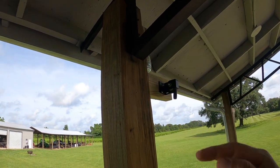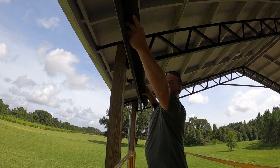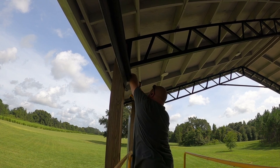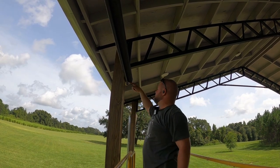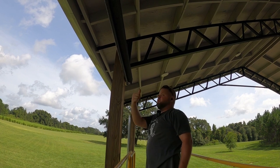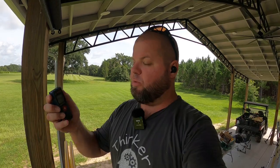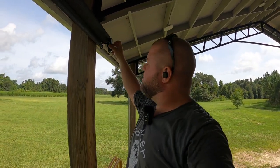I really want to push this in before I tighten it down. I'll snap this other end in, get everything pushed together nice and tight, and cinch it down. For good measure, I'm going to put some extra screws in those sliding slots to make sure this never slides out. What I did to make sure I had everything level and could work by myself was use my handy dandy laser tape measure. Found the center of this bracket once I mounted the wooden piece up here, and measured to the ground — it was 11 foot and about 5 sixteenths of an inch.